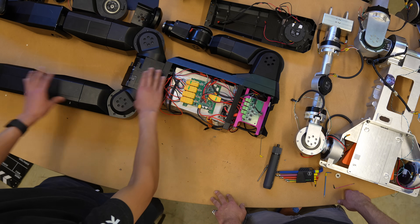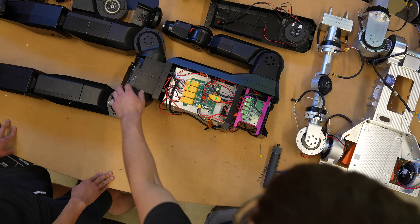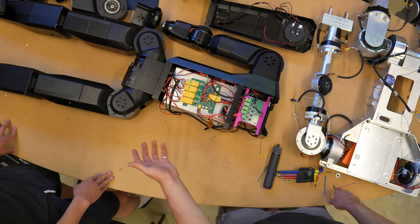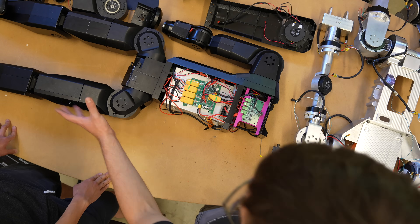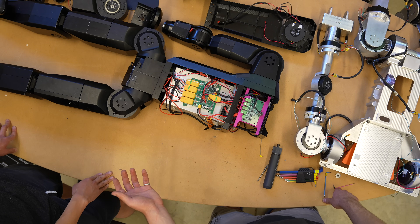What has allowed us to do this is a lot of the advancements in actuator technology. You can see here this RS04 actuator at 120 Nm. A lot of these quasi-direct drive motors have both dropped in price and increased in performance recently, and that allows us to package the torque we need here to still be moving the leg under high load situations quickly.